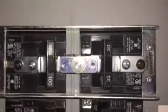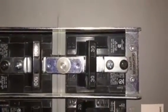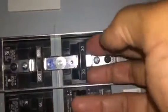So when I took out that other circuit breaker, I wasn't really losing anything because I have a circuit breaker for protection here. And so coming over here, right now I have it set to where all of the power is coming in from the utility. So what I need to do is switch this, and now all the power is being passed through from my solar.